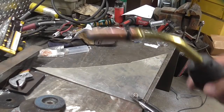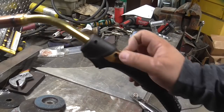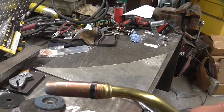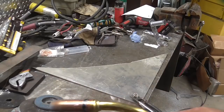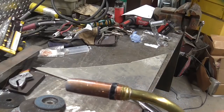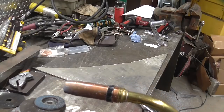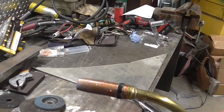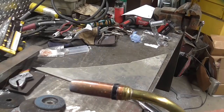I'm in 2T mode. I'm not using any form of remote control — no amperage slider, no potentiometer, no foot pedal. You will hear that the hot start time and the slope down time, if I have any selected, is going to be single pulse, and the actual welding will be double pulse. The way I have the parameters picked pretty extreme, you will hear the first one or two pulses at a different speed and intensity before it goes to what I've really selected, to have a smoother transition.